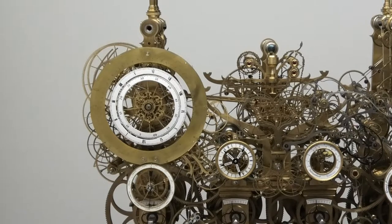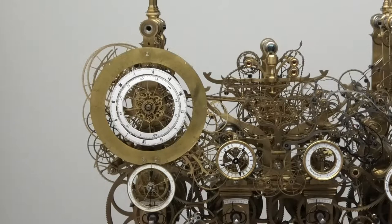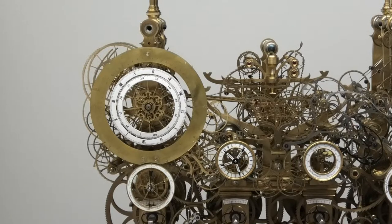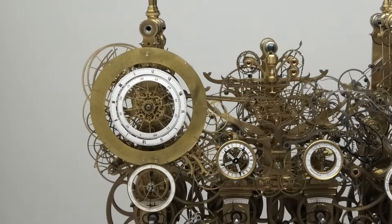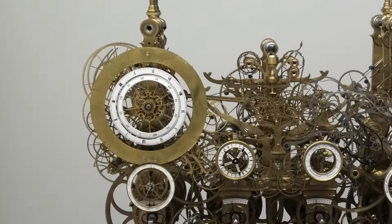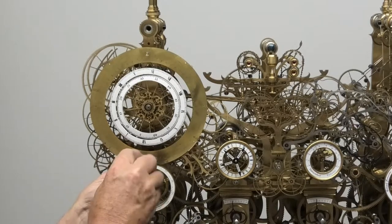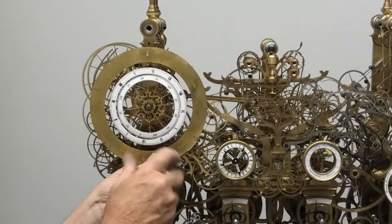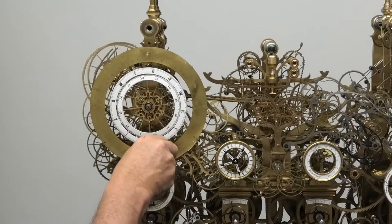The next stage is to remove parts in the front section of the clock that are preventing us from completing dismantling. The main time dial and its dial plate will be fitted with latches, so they will be easily removed. At the moment we just have a screwed-on dial plate, and this will be changed. So it's a case of unscrewing the screws on the dial pillars.